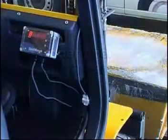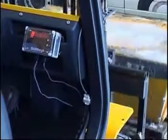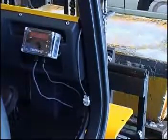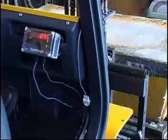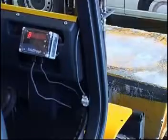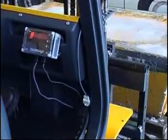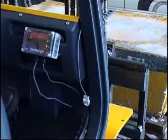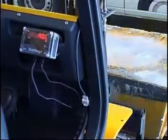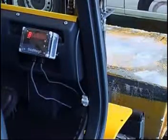When the number 8 is shown in the mode display, the system is ready to weigh the product on the forks. Activate the lift control lever quickly and lift the load just above the ground. Do not attempt to tilt the load or move the vehicle or lift the load higher than just a few inches above the ground. As soon as the load has been lifted, the digital display will go blank for a moment and the load weight value of the product lifted will be displayed. This product load weight will be shown on the indicator until the next time the forks are lowered to the ground.